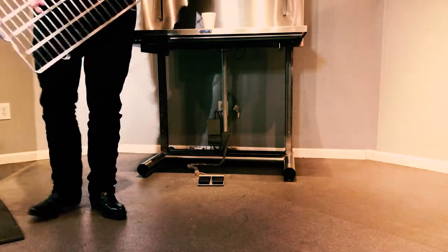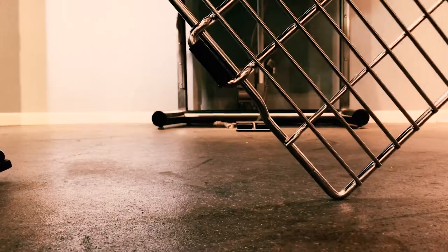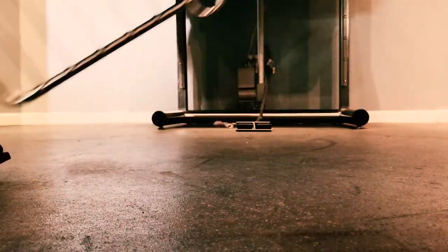Having drawn the door from its hinges, hold the door 6 to 12 inches off the ground. If your goal is to lower the upper latch side, drop the door onto the lower hinge corner.